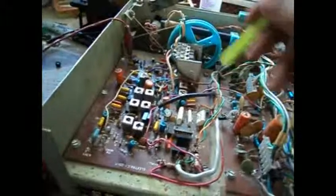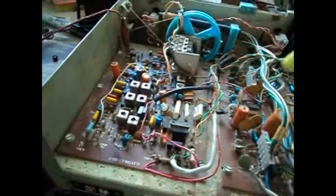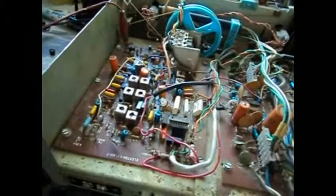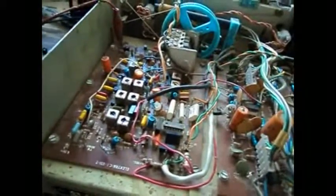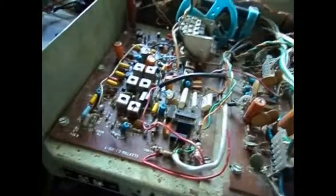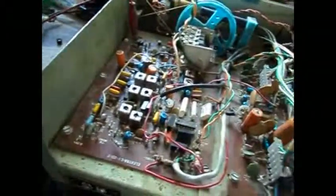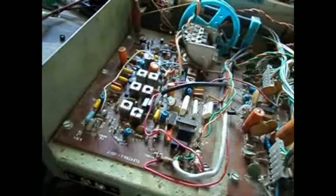So I just finished. I did the FM first, then the AM, then I went back to the FM and got it really nicely peaked up, and it's really sounding good. Playing with this thing, I got it pretty symmetrical according to that little tuning pattern that I was talking about in the previous video, and I'll try and demonstrate that.